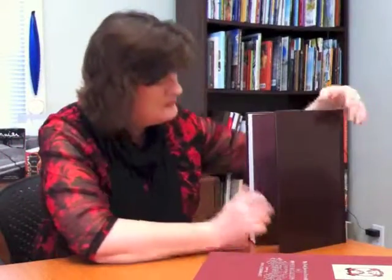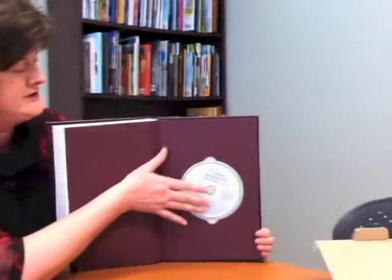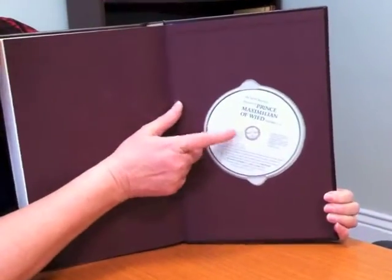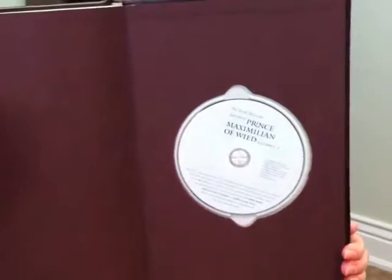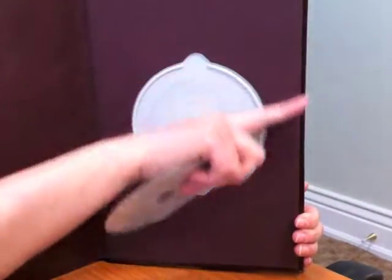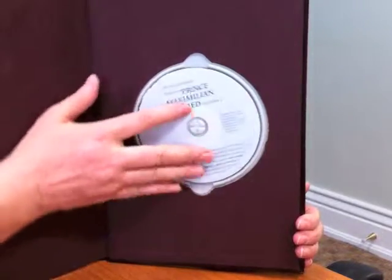But in the case of the Prince Maximilian's book, none of those really seemed appropriate. It's such a gorgeous book, and we wanted something a little bit more upscale. So we did this really cool solution — we actually cut a die-cut into the case. You have to do thicker cases to do this. And it has this plastic piece that's actually holding the DVD in place inside the case. It just looks so nice. You can see you just pop it out, and this piece is glued to the case, and then the endsheet is die-cut around it. So this piece is all the endsheet, and then that just pops back in there.